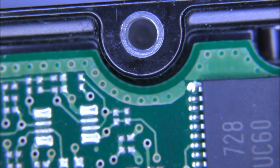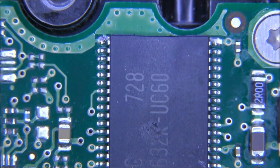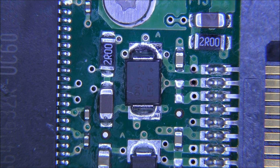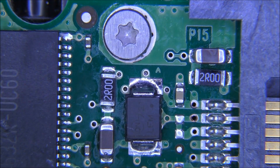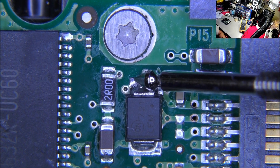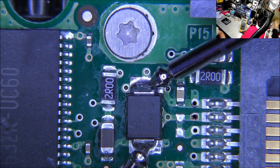This is the trouble when you're trying to do component-level work and recording at the same time — easier said than done. That's the diode — red probe on ground. Just dealing with this cable tangle, which I hate. That's the reason I bought silicone cables but obviously they still tangle. Right — that's reading 0.658. Okay, it's reading both ways because it's in circuit.